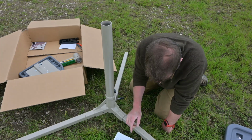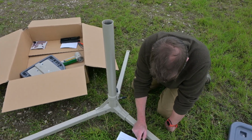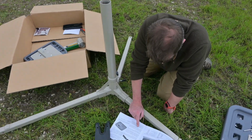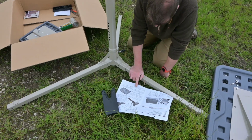Next, place the nylon bearing of centre support. We've done that. Back the centre support tube locking knob out so the tube itself will not hang up on the screw. Yes, we've done that. With the bearings in place, insert the centre support tube in the hub. Right, we've done that.